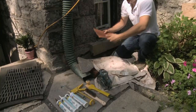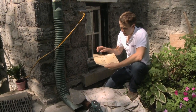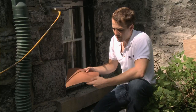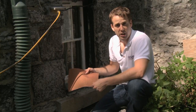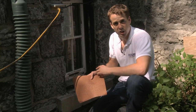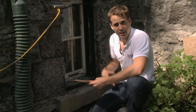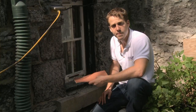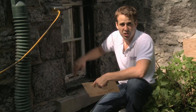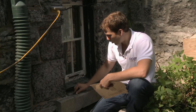There are many different types of sandpaper you can use, all measured based on grit. On the back it says 50 garnet paper — the 50 refers to 50 grit, meaning for every square inch there are 50 pieces of sand. We can go to 80 grit, which is finer, because the more pieces of sand per square inch, the finer the sandpaper. 50 grit and 80 grit are typically your exterior grade sandpapers. Interior sandpapers are 80, 100, 120, 150 — for sanding things like drywall and plaster on walls, which have to be very smooth and fine, not as coarse as ragged old paint chips.